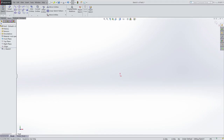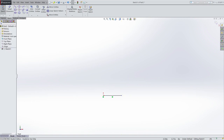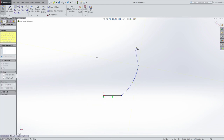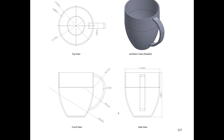The basic shape is going to be a line, and I'm going to start that at the origin, then I need an arc, so I'm going to draw a center point arc, and then I'm going to draw another line. That'll give me my basic shape. Now I can start to constrain and dimension that shape. I know that the inside is going to be the same basic shape, so if I dimension and constrain the outside, I can just copy that to make the inside surface.